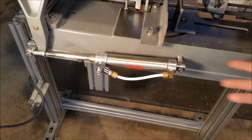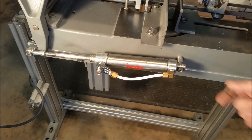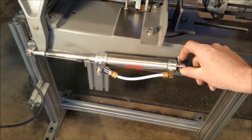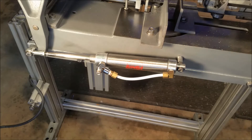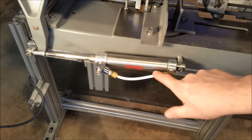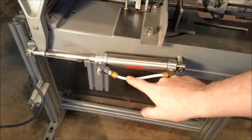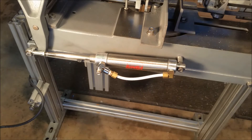The cylinder is nearly perfect. I'm using the original hole and the original mount with my hardware. I still have to do a little work here — maybe make this bolt a little longer — and for a good pivot point put a nylon on there. I'm just using plastic when playing around with it initially. This will need to be upgraded to copper because I think maybe over a hundred PSI happens here.